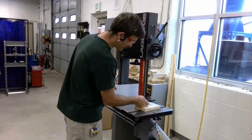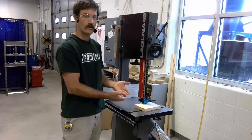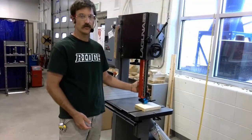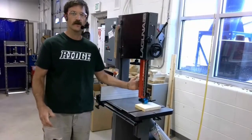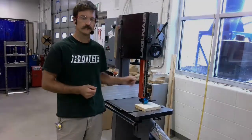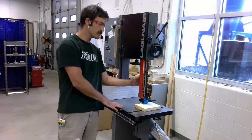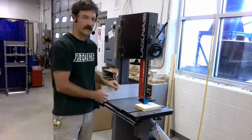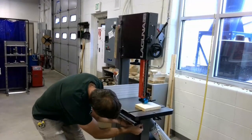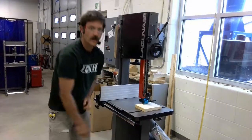I have double checked that this is correct. If my piece of material were much thicker or thinner, I would need to make an adjustment to my guard. If you don't remember how to adjust the guard on this machine, you can check out the setup video. So that's the second step — making sure your guard is set correctly. We've also cleaned the machine and need to raise this lower guard up and lock it into position using the two thumb screws underneath.